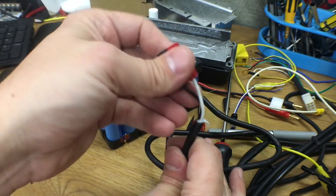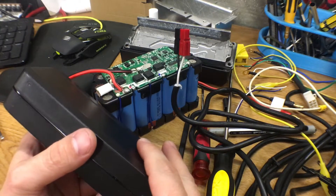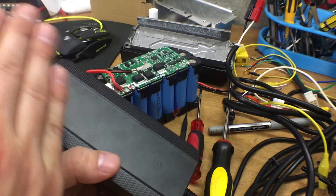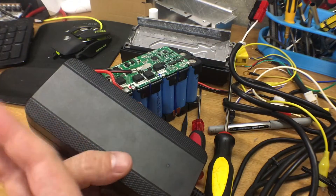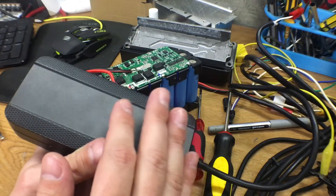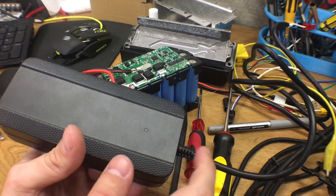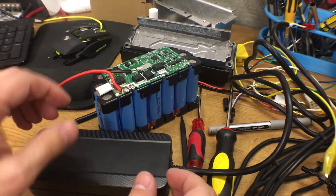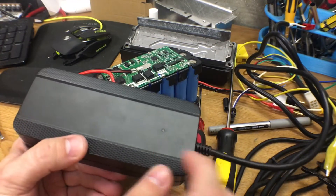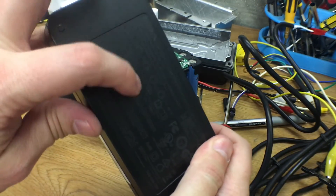After getting that updated, I wanted to modify this charger. You have to put yourself in the shoes of the factory worker who assembled it. At the very end of the line, they've built it, tested it, connected it to a load, made sure it didn't brown out or sag in voltage. One of the things they'd do is measure the output — this thing won't be dead-on — so they might swap in different resistors or adjust something to dial it in to the manufacturer's spec.